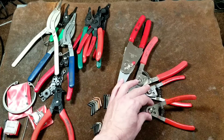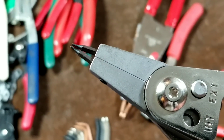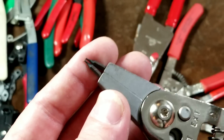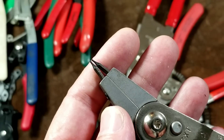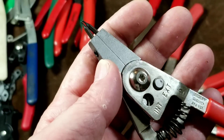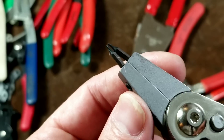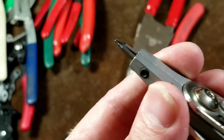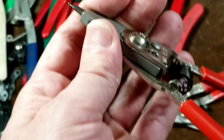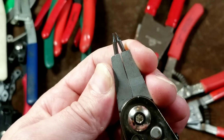What makes these so great — the Hitech and the KD tools — is several points. Let's go ahead and take a closer look at one of the smaller ones. First, they have good construction quality. They have solid jaws and interchangeable tips. There's a variety of snap ring pliers that have interchangeable tips, but this particular style has really taken over. The only situation where they're not totally universal is that the thickness of the upper jaws has sometimes prevented me from getting close enough access to a particular snap ring, but that's pretty rare. These are really rigid — they don't want to flex around. They're very convenient and reliable to use.